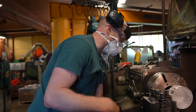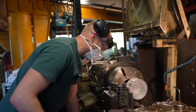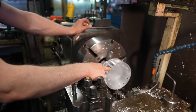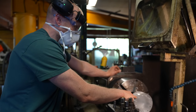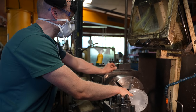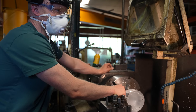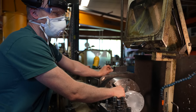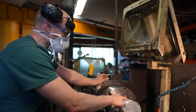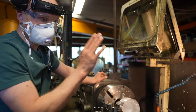There should be room to breathe for the O-ring, but we don't want it here because it looks ugly. There is a 0.5 millimeter space between this and the cylinder. So if we make a 5 millimeter deep groove, then the O-ring is going to squeeze 0.5 millimeter. I think it should squeeze more to get a good seal. I'm going to take 8 millimeters out from the diameter, so it's 4 millimeters deep. And let's test after that.